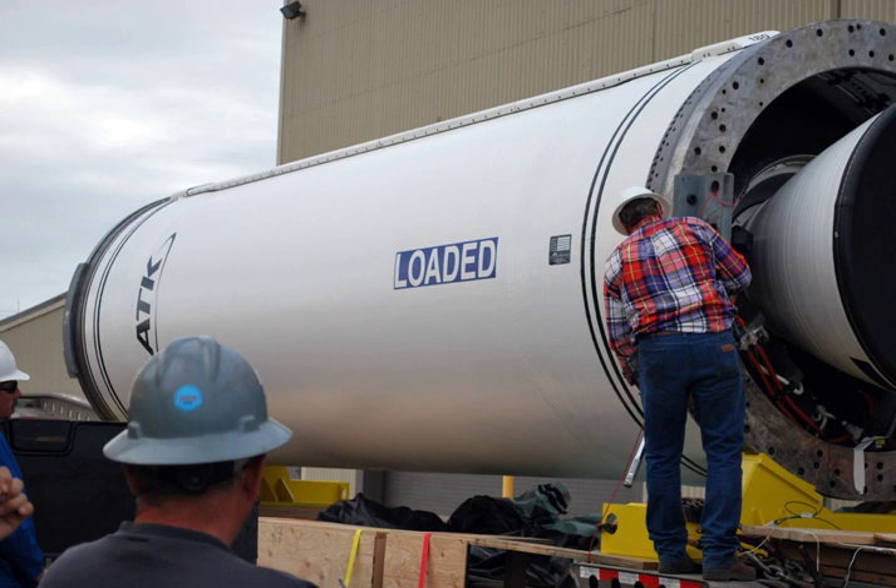Castor-600: The Castor-600 motor is a proposed booster based on the Space Shuttle solid rocket booster, intended to be used as the first stage of the Omega's small configurations. The inaugural flight could occur as soon as 2020. Based on a two-segment Space Shuttle SRB, the Castor-600 measures 860 inches in length and 146.1 inches in diameter, and weighs approximately 600,000 pounds. It will use technology derived from GEM motors with carbon composite cases and HTPB binder.